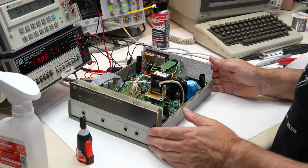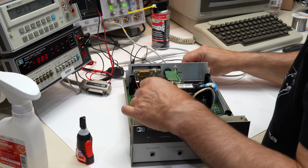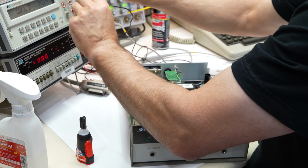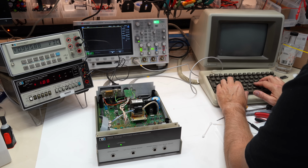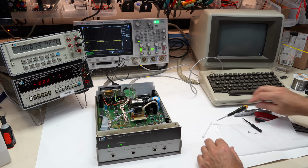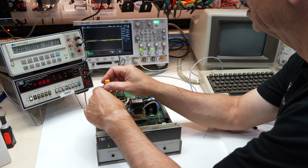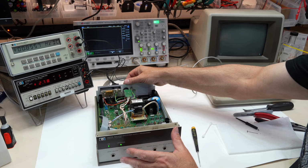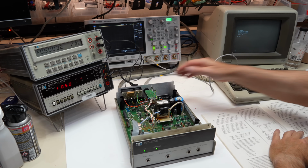Alright, so that's the issue with analog instruments where the switch is in the analog path. That is not ideal when the switch ages. So if I go now to bipolar and I go into my program, there you go. But now I can zero it. Alright, and then I get out of it, and I get back in, I get out of it, and I get back in, and now it's stable. Okay, let's do the alignment procedure once again.